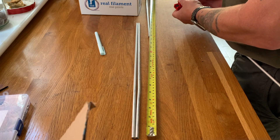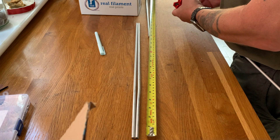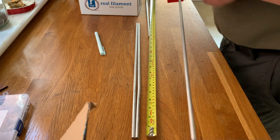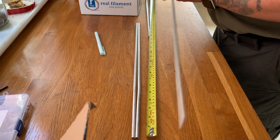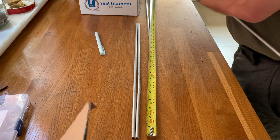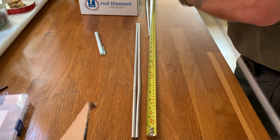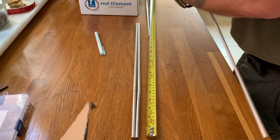A two meter band Skylab for the 144 megahertz band. To start with I'm going to need five lengths of rod, because this is going to be a four-legged version rather than a three-legged version. Five lengths of rod, all of them 50 centimeters in length. So that's what I'm cutting.